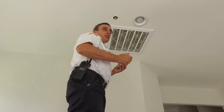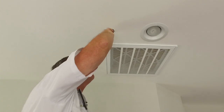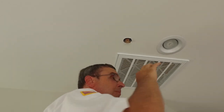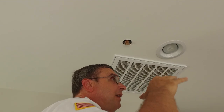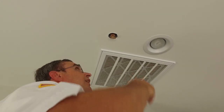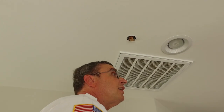There are two reasons why you don't want to paint your sprinkler heads. First, the deflector causes a special spray pattern, and any paint will disrupt that deflector and disrupt the pattern. Also, if you get too much paint on the sprinkler, it could cause it not to go off when needed, or respond later than it should.